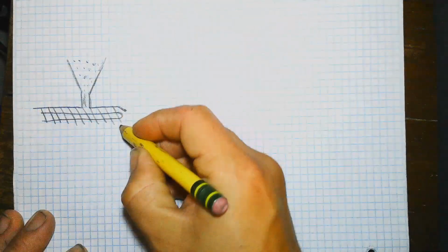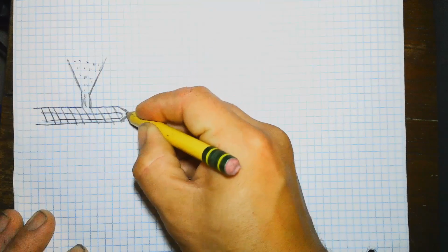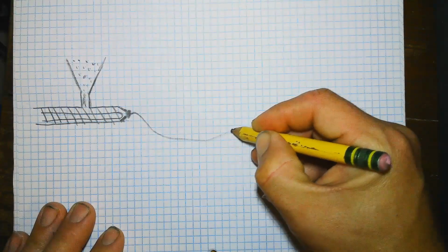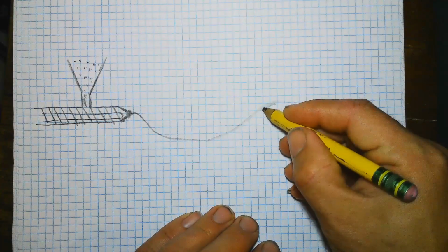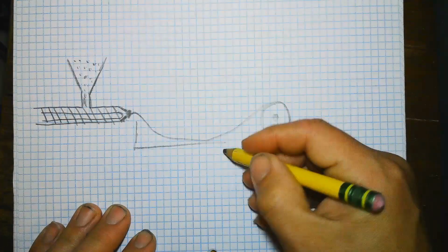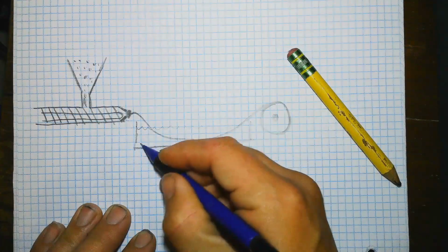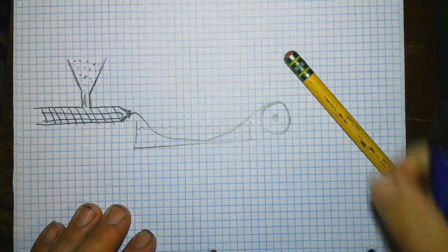Conventionally, filament is extruded from pellets using a screw-type extruder like you'd see in injection molding. The stream from this extruder is subsequently dipped in water to cool it down. It's dried, fed onto a take-up roller whose speed is controlled, and then it's spooled up. The control of this process is more or less down to the speed of the take-up roller. Pulling the extrudate faster will thin it out, while pulling it slower will make the filament thicker.